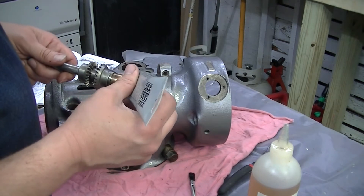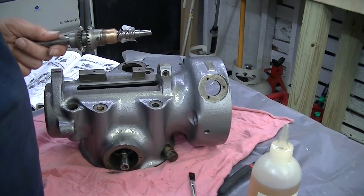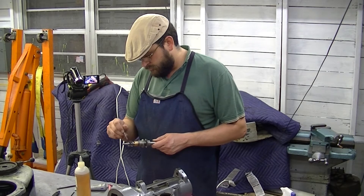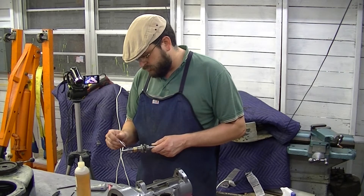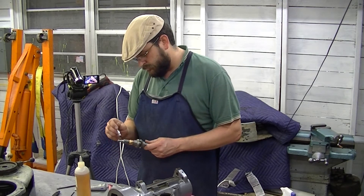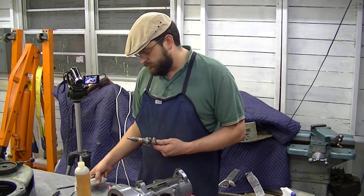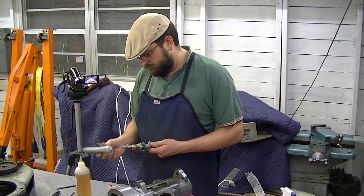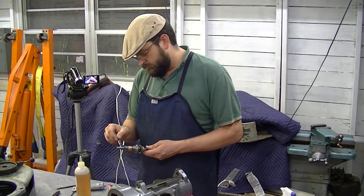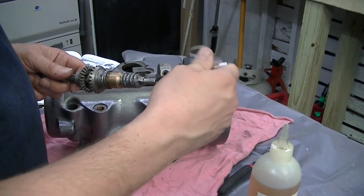I'm going to go ahead and put our Teflon grease over these parts real nicely. The reason I'm using the Teflon grease is because I've got some question as to whether the oil in this mill is actually reaching these parts, and I don't believe it is — at least not like it should. So I'm going ahead and putting some grease in it. I'm going to not overdo it, but I'm going to make sure it's got a pretty good amount of grease. And from the looks of it, I'm not the first person to work on this mill — it looks like the last person who worked on it came to the same conclusion, because they also greased these same areas.